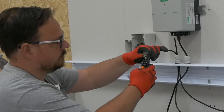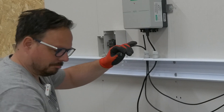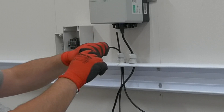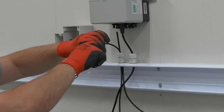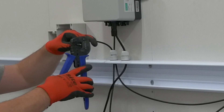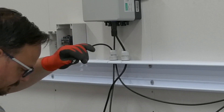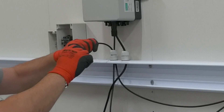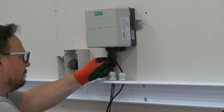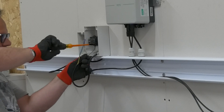This is the HILUX solar terminating kit and it comes with everything you're going to need to get that done. A really high quality ratcheting crimping tool so our MC4s are going to be securely fastened. There's a whole load of adapters in there as well to help you tighten and remove MC4 plugs. We absolutely love it — we've been using it on every single solar job so far because everything you need in terms of your MC4 is within it. You can see getting it nice and securely clamped onto the DC cable, then making sure we're tightening up appropriately the gland on the back, going over that with the appropriate tooling to ensure they are properly tight. Then we plug them onto the input side of the ProJoy, making sure we get those in the right place.